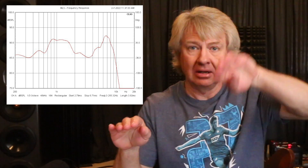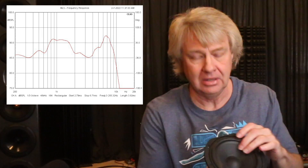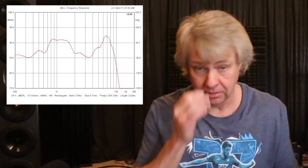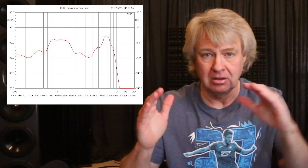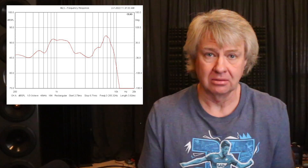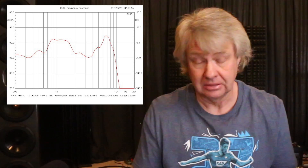So to start with, let's look at this little woofer's response and see why it needed a notch filter. If you notice in the response, the woofer's response starts here and it has a big kind of a broad range hump, and then it carries out there a little further. Then there's high ringing at the top - there's breakup at the very top of the woofer's range. Even though this is a paper cone woofer, it's a really stiff cone. A lot of those heavier stiff materials - or even lightweight stiff materials like metal, metal cones, Kevlar cones - a lot of times you see the frequency response ramp up at the end. That's where it's starting to ring, and you have to use it in a pass band that's well before that and notch all that out with the crossover. In this case, it's right in the pass band - the pass band means the band that you're wanting it to pass through.